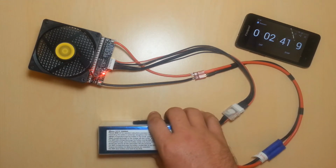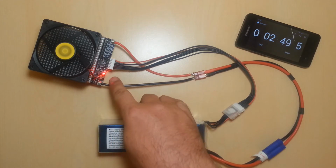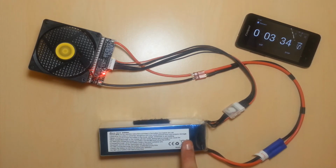Another feature, which is a big safety feature for LiPo batteries: when the discharge cycle completes, the green LED turns on, the red one goes off, and the fans are still running. Obviously, it takes a little bit of power to continue to run the fans. Typically in about a minute to a minute and a half, the discharger will already be cooled back down to ambient temperature. But if for any reason you've forgotten that a battery was connected to the discharger and you're out doing something or you left, there is a safety feature built in: when the discharger reads 3.75 volts nominal cell voltage, it will completely shut down. LEDs won't be on and the fan will no longer run. Again, this is a safety feature to prevent any connected battery from over discharging.